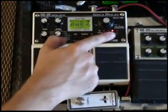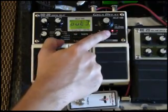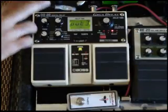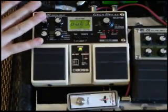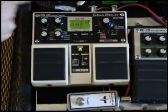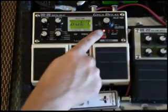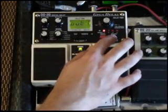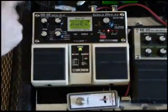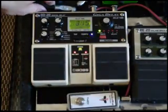Now it says out 3. Output 3 means it's at plus 4 dB, and it is just a single... now it's got stereo output on it, and so whatever's coming out, it's the wet signal coming out. Output 4 means for the stereo, one is going to be dry, one's going to be wet. Output mode 1 is negative 20 dB, that's the factory setting, and everything's wet. And then output mode 2 is a wet dry on the stereo output. I keep it on 3. Press right, you're done. Okay.